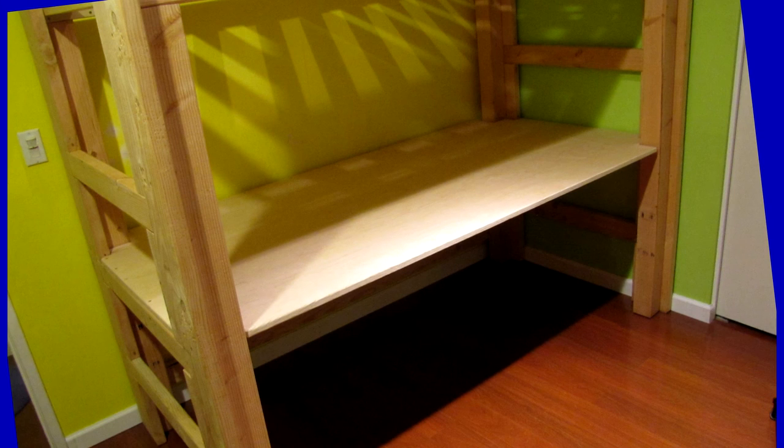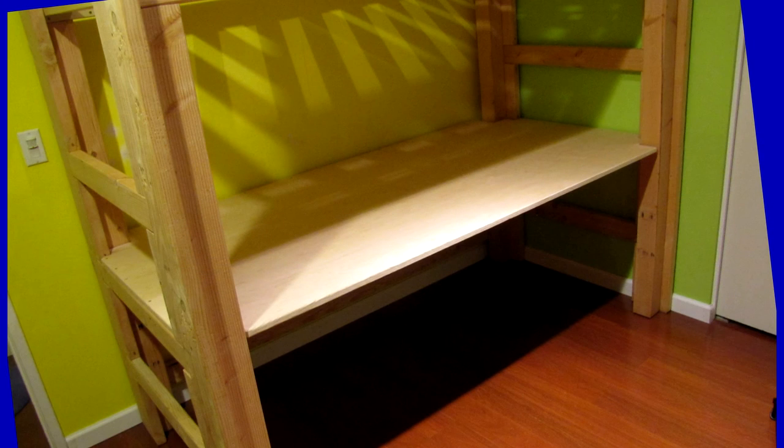So you need to make sure you leave a gap there. You're not going to get it in if it's too tight, those dimensions. Unfortunately, I made a bit of a miscalculation with this step and found it very difficult to get the plywood table in one piece onto its supports. Hopefully, with the cutout dimensions I gave you, you should be able to slide the table in through the top after you remove the struts and sort of slide it in through the top and then lay it down on the middle step and the two by fours.